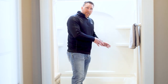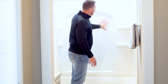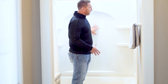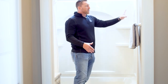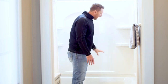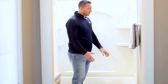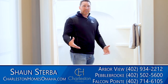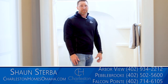Again, it's very important not to wax the floor because that would become a safety issue — it becomes slippery. But the side walls themselves, if you've got some hard water mineral deposits built up, just use a buffing-type compound that's non-abrasive. Anytime you're cleaning these, use a terry cloth type material or maybe a paper towel, and always test your cleaners to make sure nothing is too corrosive on the units. They are acrylic units and very durable. If you have any questions, check out our website at charlestonhomesomaha.com. Thank you.